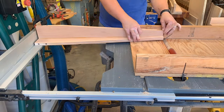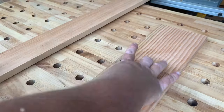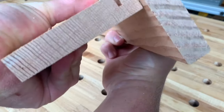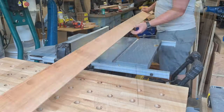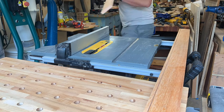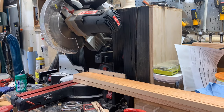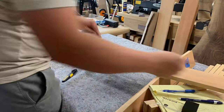When they're all glued up and dry, I'm using the sled here just to make sure they're uniform length - I got a stop block on the fence. Now it's time for those stretchers. The way I'm going to attach the tabletop is using Z clips - I'll talk more about that at the end of the video. But you've got to run a groove in your stretchers or aprons first. I'm just running it through the table saw - the width of the blade is perfect for it. You can also use a biscuit joiner if you want. Do some test pieces first just to make sure you got it where you want.